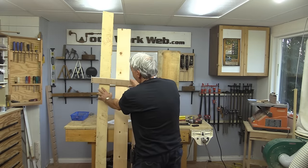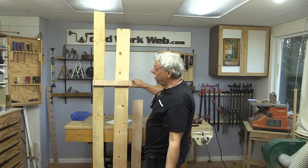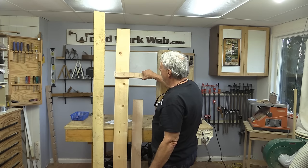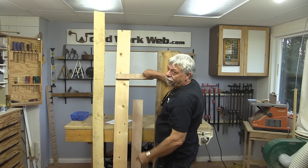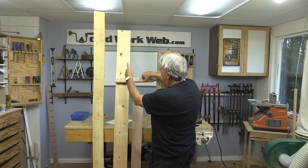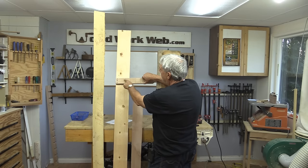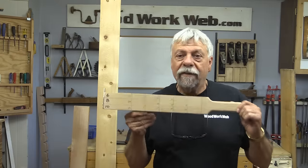I've marked four, six, eight, ten on the side but you don't really even need to know that — you just want to know how many board feet there are. Now if we look at the next one, imagine that one's seven feet. This one is planed, and when wood is planed you need to go to the next biggest size usually, because they've planed that wood off but you still have to pay for it — it's sawdust now. So they'd call this a six-inch board and we're saying it's seven feet. I'll go between the two: if it were six feet it would be three board feet, if eight feet it would be four board feet, so I'll say three and a half board feet. It's that simple to use.